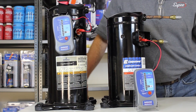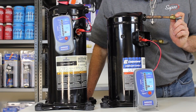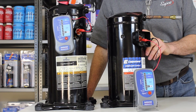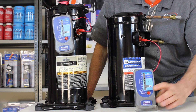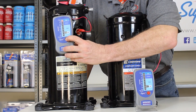We've had a lot of questions and concerns about the M500 testing scroll compressors. The most important thing you can do is make the connections right at the compressor itself and not at the lead wires that come off of it. This particular one is a good compressor, as indicated here. This particular one here is a bad compressor, as indicated here.